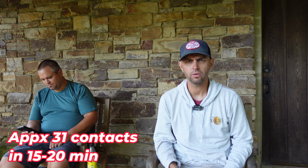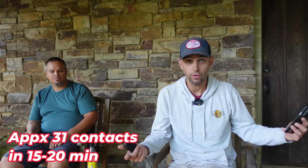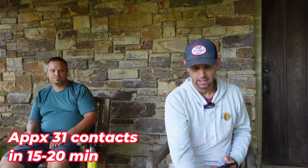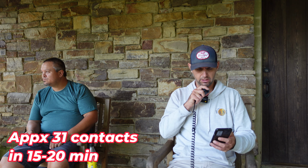I'm going to mention here real quick on this video that, yeah, you should probably still have a counterpoise wire on there and absolutely have a choke on there, a one-to-one choke at the actual point of the antenna meeting the coax. I don't feel like I should have to tell you, but somebody will mention it anyway, so why not tell you? CQ parks on the air, CQ parks on the air.